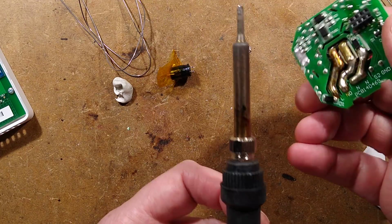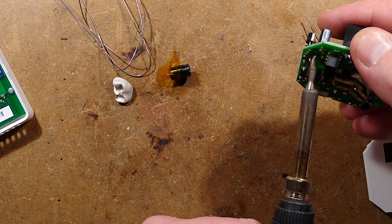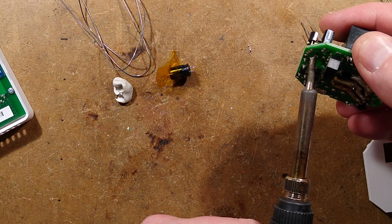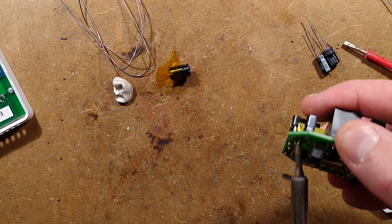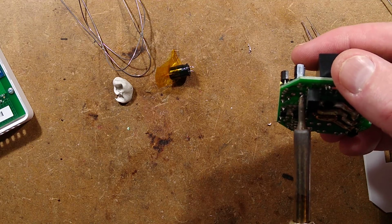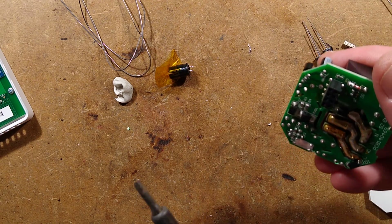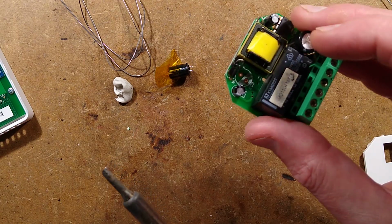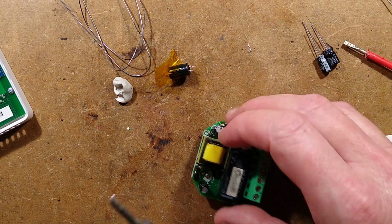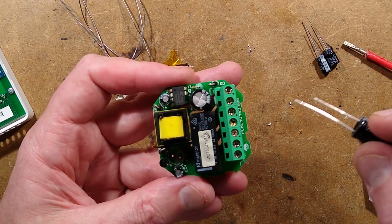Now comes the way to clear the solder out of those holes. I could use the toothpick approach, which works quite well, or I could try the bang it on the table approach, which makes quite a lot of noise, but also works pretty well. You heat the solder up and then you bang it, and theoretically the inertia makes the solder fly out. Those holes are fairly clear now. Is my new big fat ugly capacitor going to fit in?